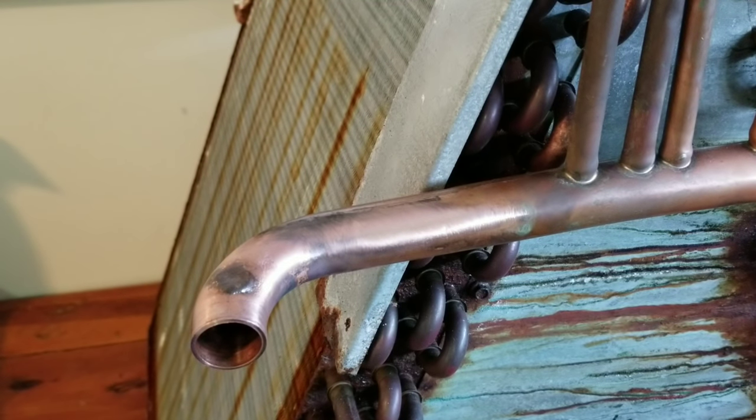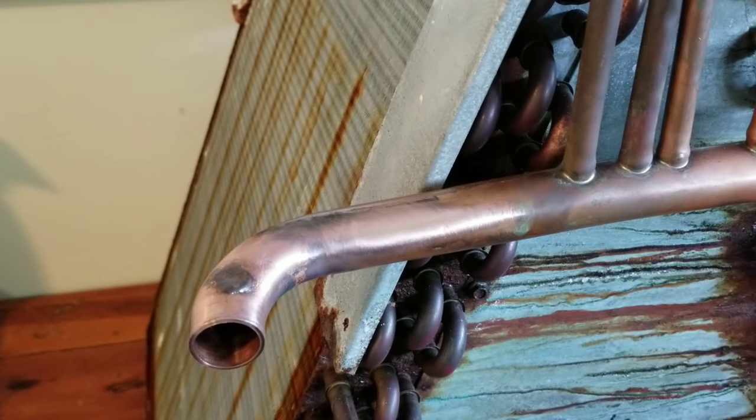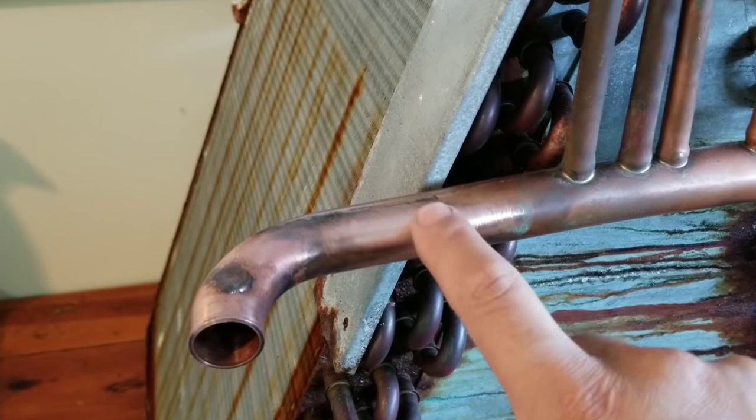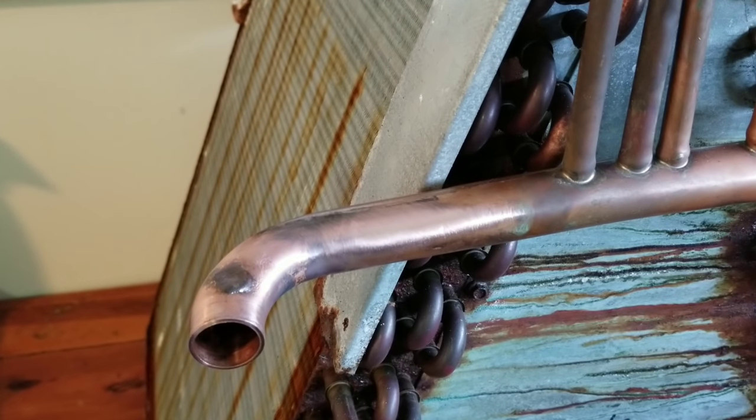What's going on guys? Just out here in the garage this morning, I was going through a few of my torch tips, cleaning up my oxyacetylene kit and it's raining out this morning. I got a couple errands to run, but while I was fiddling around with this stuff I figured I'd make a quick video. I had some comments on a previous video in regards to fixing holes, whether it's a coil, whether it's just copper piping. So what I'm going to do is take a step down bit and make a pretty massive hole in this section of pipe, and see if I can seal it up with just 15% silphos.